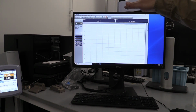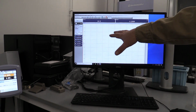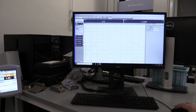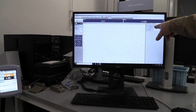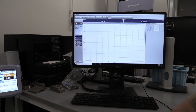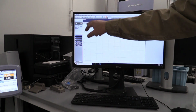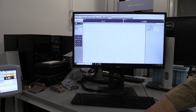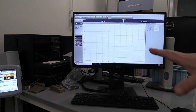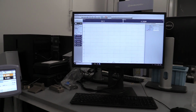Now this one is just going to come in and load the part, and we have the break detection off, so it's just going to let us break that sample, and it will report back the maximum load. Sometimes you have to full screen this, and it will come over here and report back the maximum force that it took to compress that sample, and we can pull that off of the graph as well. So you may want to take a picture of this graph, as well as you can go up to file and export that raw data as a comma delimited file and save it to your group's folder on the desktop. We've done a lot of that in past experiments, and you should know how to do that. So let's go test this sample.